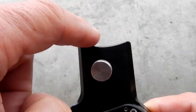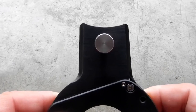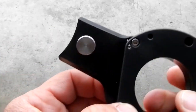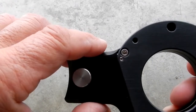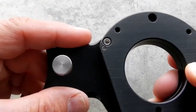You'll also notice that the dovetail is on a taper — narrower here and wider here — so that when you insert this into the adapter, it self-centers. If it were just a straight dovetail, there could be slop. The taper locks it in when you slide it into the adapter.